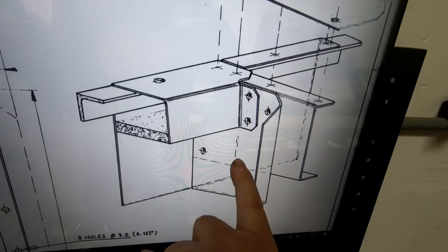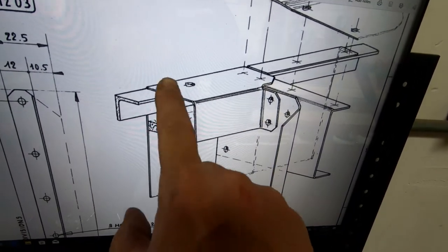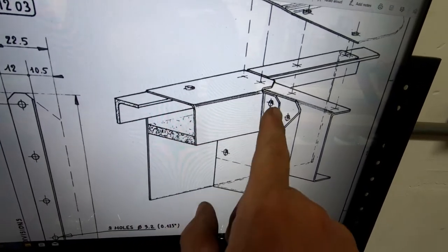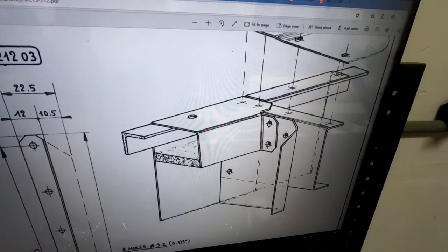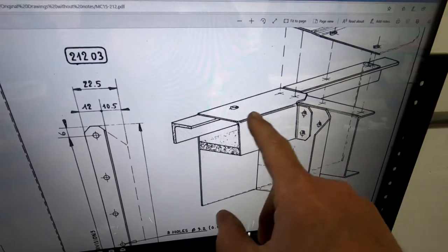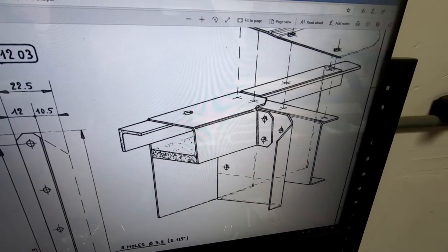So I did want to show you, this is that end that needs to be bent over for two rivets that end up going into frame 7. So what I need to do with this piece that I just bent here is just bend that end over so it fits, and then I should be able to drop this into place and just see how my angle is around here and if I need to tighten that bend at all. But yeah, otherwise this looks pretty good.